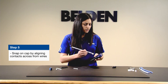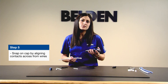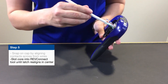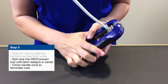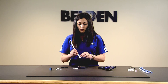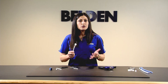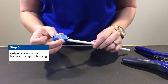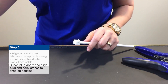This tool is outfitted with what we call the go/no-go functionality, meaning that you cannot terminate until you have properly situated the cable inside the tool. Settle it in, and then one crimp of the handle is going to push those contacts into the insulation of the wire and also cut the wires — all with one single crimp. Now you've made your RevConnect core. From here you decide: an RJ45 jack goes on very quickly, or you can snap that right off and put on your RJ45 plug.